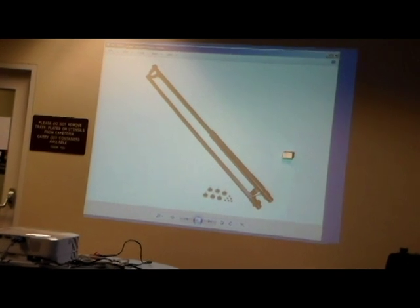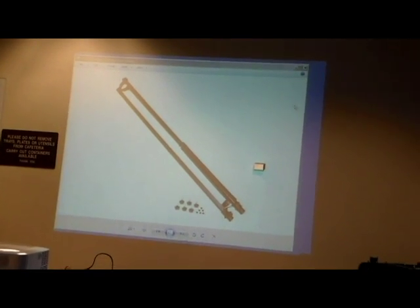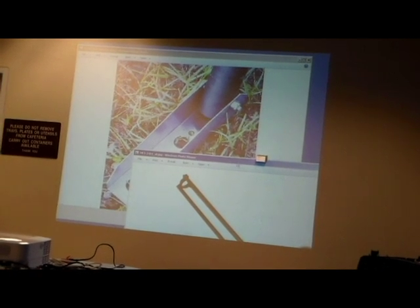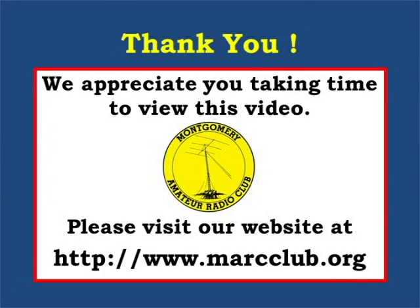If one spike goes in sort of straight down and the other spike goes in at an angle, the straight-down one prevents kickout and lateral movement, and the one at an angle prevents pull-up of the foot when the stress is towards the other side of the tripod. That's the consensus of all the sites I could look at. I've had a similar thing with my satellite antenna — some of them have problems with the tripod legs. I've got a two-by-six that's long on each of the three feet.